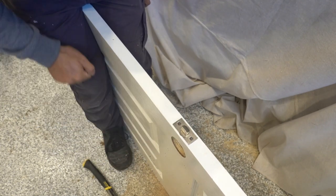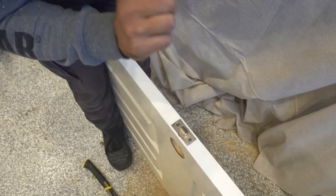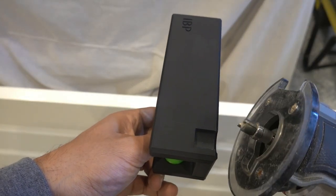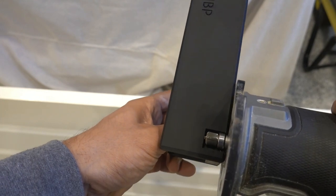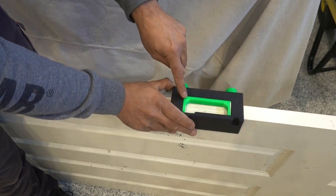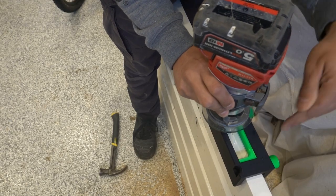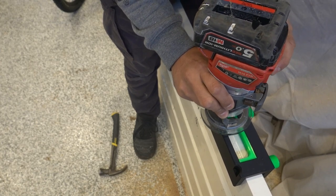And that is a nice perfect recessed latch — nice and simple using the jig. Now it's time for the hinge jig. On the side of the jig you'll notice a little depth gauge — simply take your router and adjust it to the correct depth. Then take your hinge, drop it in place, and we've got the little insert in for our 90mm radius. Clamp it in place and take the router, plunge it in, and travel all the way around.